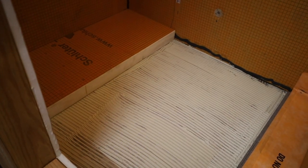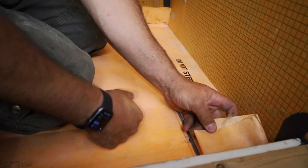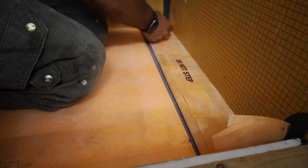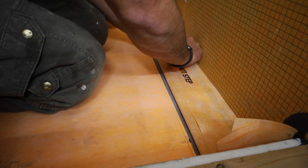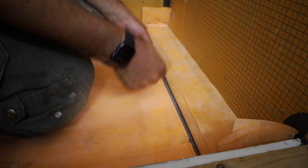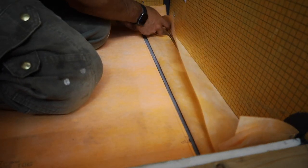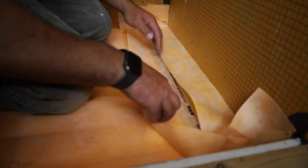With our piece of 2-inch in — this piece is merely for support of the toilet because that area is going to be flat — I'm going to place a bead of caulking on the front edge of it as well to seal between the pan and the 2-inch piece, and then we'll go ahead and get the pan installed. Now we get to work on the drain flashing. Go ahead and remove all the tape they put on there to begin with — I like to peel it all, even the 'do not step' one, because thinset doesn't adhere very well to tape. Then I like to do just a dry fold so I can see how I want it to lay and get a good idea of what I'm working with.